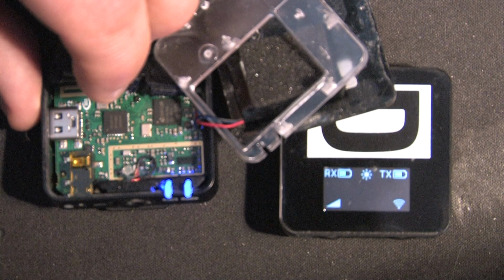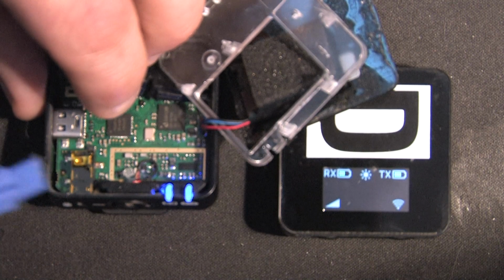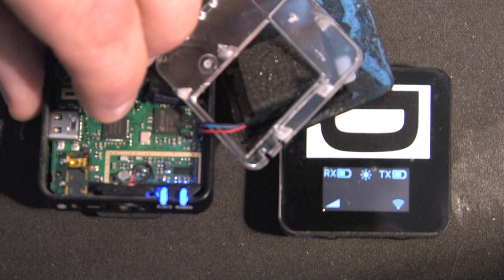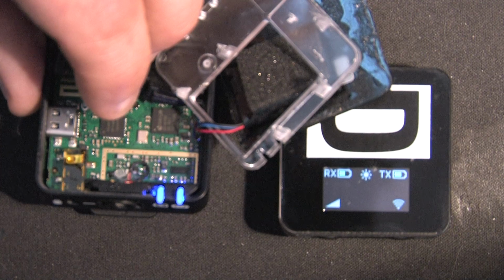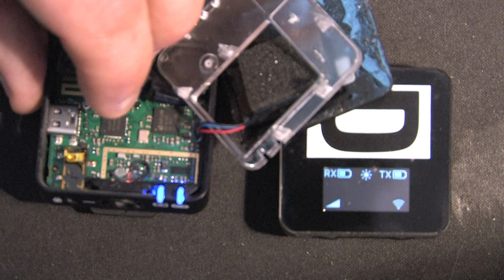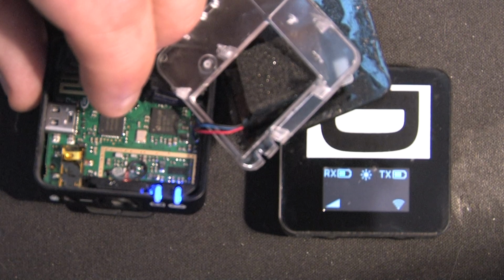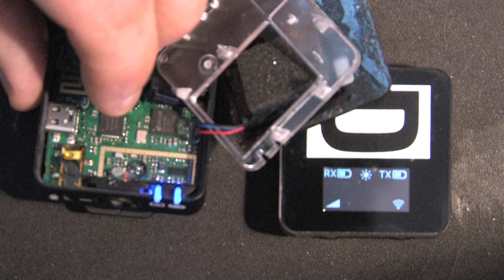And I think it's the tape. Somebody has stuck tape onto this socket. So there are two fixes that I'm going to try. The first fix, I'm going to remove the tape and see if the connector then naturally returns to a closed condition, which then will allow the internal microphone to work, as well as the external microphone. And if that isn't it, I'm going to assume that the socket is broken, and then I'm going to change the socket. But I'd be happy just to get the internal mic working, so I could even just bypass it to make it actually work.